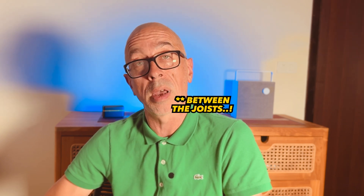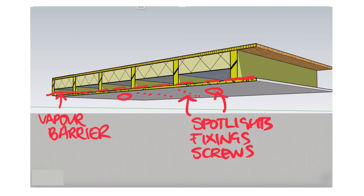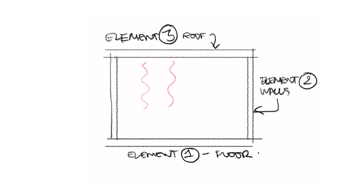Back to this insulation between the rafters with the roof deck on top — there are a load of YouTube builder and DIY experts building and explaining using this solution, and honestly I don't think it's the right solution at all. I've not even mentioned the vapor barrier: they're suggesting it goes along this line, then cutting a load of holes in it for services and lighting, rendering it completely useless. The most important area for your vapor control is the ceiling, since the majority of vapor is rising upwards. Don't get me wrong — I think these guys are generously sharing their considerable knowledge and I've learned so much — but I don't want you taking these ideas with your hard-earned cash and time without getting your head around all the facts.